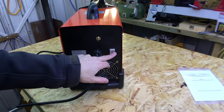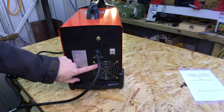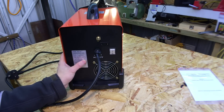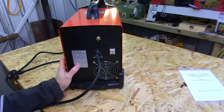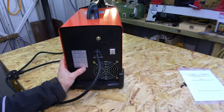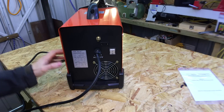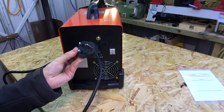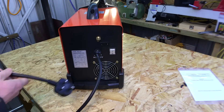There's an interesting power switch and a little cooling fan. Looking at the duty cycle label: on the MIG side you get 100% duty cycle at 103 amps, and 35% duty cycle at 180 amps. On the MMA or stick welding side, you get 100% duty cycle at 89 amps and 35% duty cycle at 160 amps. Total input power is 15.7 amps, so you can't run this at full power on a 13-amp socket - you'd need a 16-amp supply.